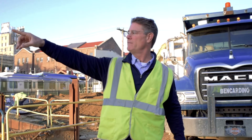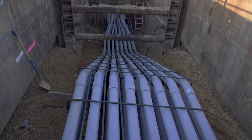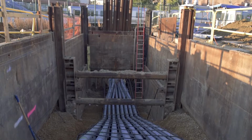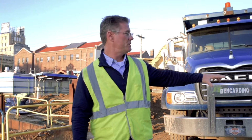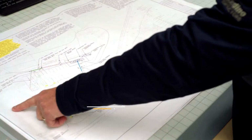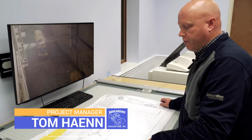As you can hear, the trains are driving by as we're going underneath the tracks. We're going to put electrical conduits in, about 25 4-inch electrical conduits. They're going to come up on both sides, and a new electrical substation is going to be over here with new concrete foundations. Over in this area right here is the 69th Street terminal. Out here is Market Street.